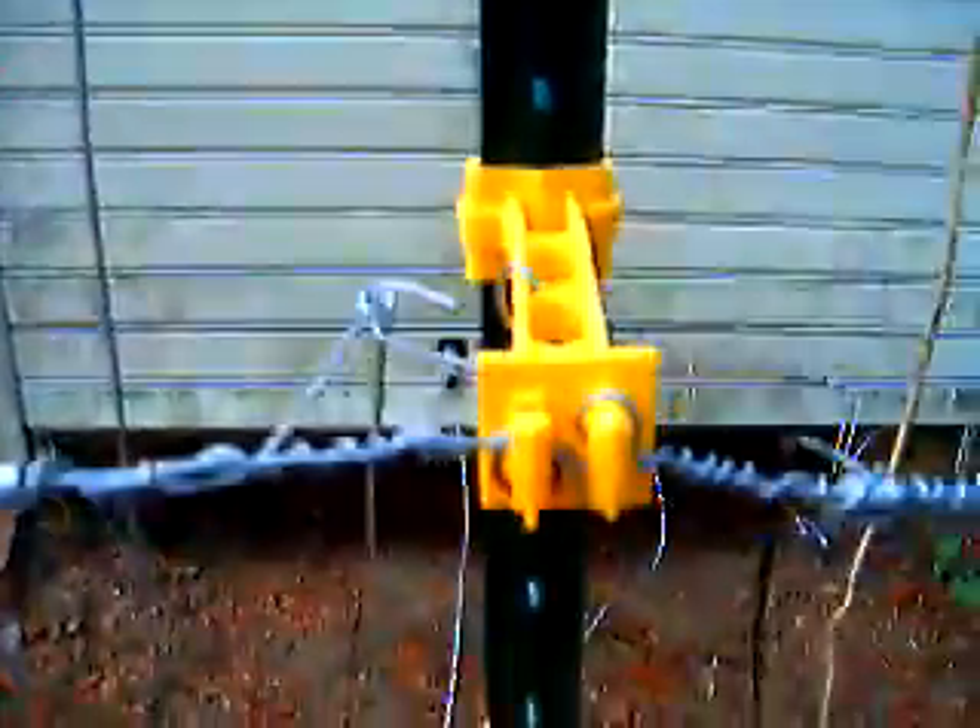We've got the back here and a bucket where we'll put extra feeders and stuff. But this is the most interesting contraption we've designed and built. Wires come out of the chicken coop — the bull zapper's in there. Our first wire is hot, our second wire is grounded, the third is hot, then ground. And our bottom one, at six inches, is hot. We have two direct hotlines beating the others. Over here we have insulated wire as a backup to connect everything. We've also ran a secondary ground wire over to our grounding rod, so we have it double grounded — because the ground is half of your fence in an electric fence.